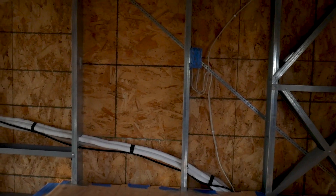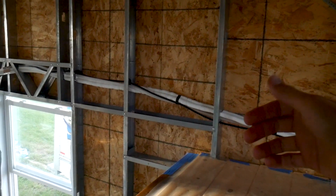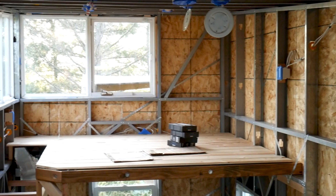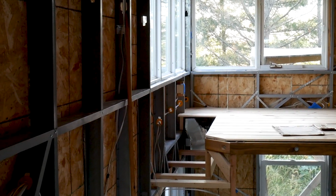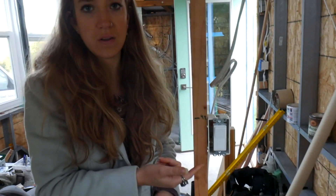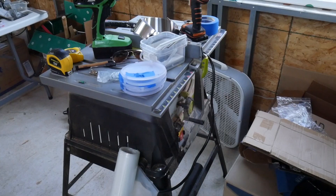For a quick pan of our preparation: we covered the outlets, taped all the mini-split lines together so they wouldn't fly out, and covered all the lights. All the wires everywhere have staples pushing them against the wall. Another good thing to do before you tape over your outlets is to test the circuits and make sure they work — you'd want to do that before you spray foam, because otherwise you'd have to dig into the wall.